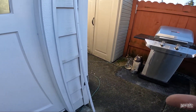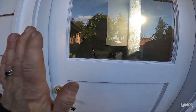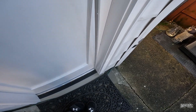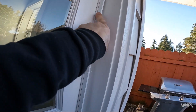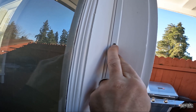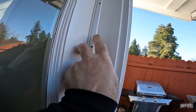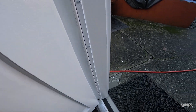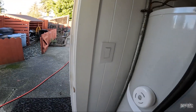I've got 13 screws and 13 holes. We just got to put this up there. The door is locked right now, so it's in its full outward position. You just take the weather stripping — it's already been cut — and kind of pack it into that pocket down there. The nice thing about it is this weather stripping is adjustable. You've got the little hole right there, and you can adjust it in and out just a little bit, because it's not a round hole, it's a square hole. I'm putting a round screw into a square hole. We have one more side done. I'm working on this one right here — it looks like it's done but it's not. It's just kind of loosely in there right now until I can adjust it.